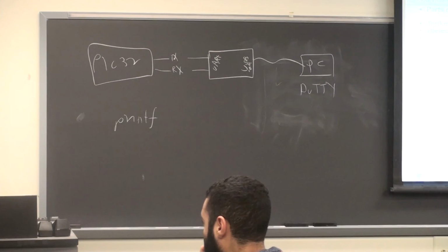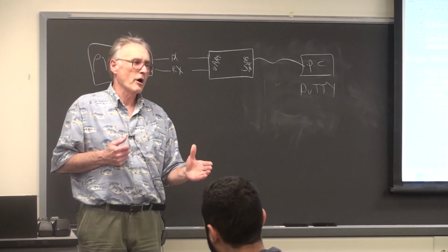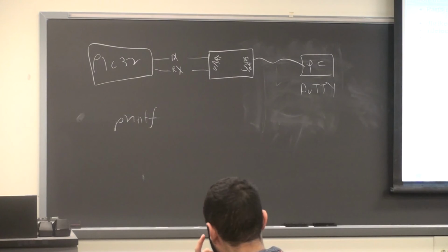you can turn the thing noisily to a position and then just turn it off and let it sit there and it'll be quiet. One other thing about servo motors, I see people all the time messing with the servo motors. They'll get a servo motor, put a wheel on it to run that wheel back and forth. And there's a gear train inside that has like 100-to-1 reduction. And as you torque that thing back and forth, you're spinning up this motor in different directions, and you will destroy the gear train in short order by physically torquing a servo motor back and forth. Don't do it. It is a number one failure mode for servos after overvoltaging.